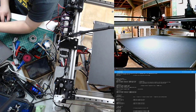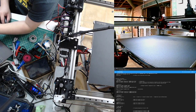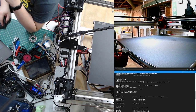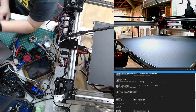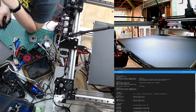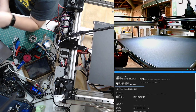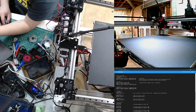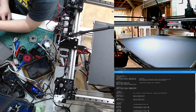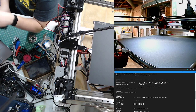Yeah. Okay. So I left the model with the thrust cage model that I've got. I left a centimeter spacing between the Z lead screw and the top motor shaft, with a 25 millimeter motor shaft, which is why the 7 millimeter spacer needed to go where it was. Got it. Okay, so it really is being pushed down quite a bit. Yeah, and you can only put about 8 millimeters of shaft into the coupling, the ones that you called out, because that's all there is to grab onto, because of the way the coupler is made.